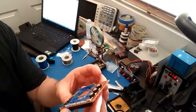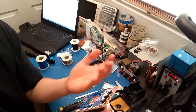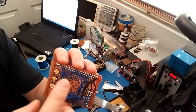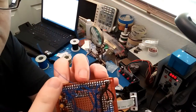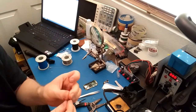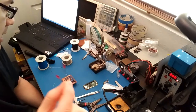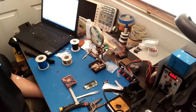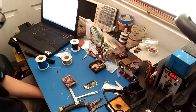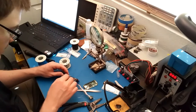And now I just need to do the LEDs and the capacitors, and then I gotta figure out how to program the CPLD. So these two wires I left floating here, if you can see those, are for the two LEDs. And here are my two red LEDs. They say to use green, but these are all I have. And they want a 1K resistor for those. Seems kind of high, but I'm just going to do it anyways. Okay, I'm going to start soldering the LEDs on.